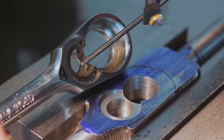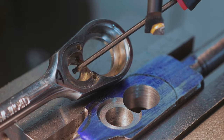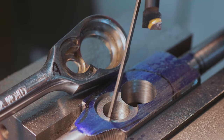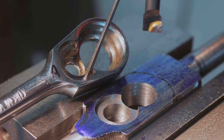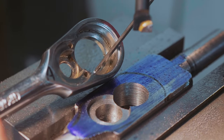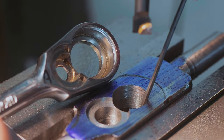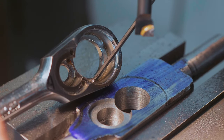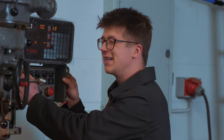Here's what we're copying. We have this depth created, this through hole. On the example we're recreating, we've done all the hole work on this side. We're now moving over to our large hole here — this is 24 millimeters, we've made that 24 millimeters — and we now create our main counter bore. It's happening. This DRO is so useful, not only for finding where the holes go, but also for the depths — I'll show you how I'm using it.